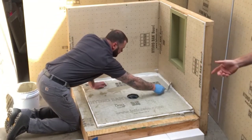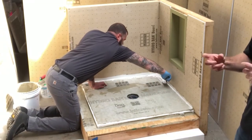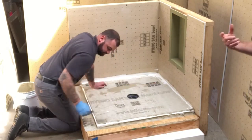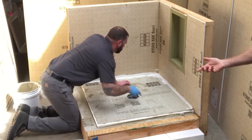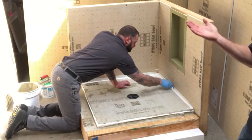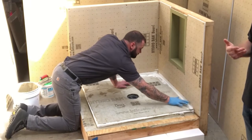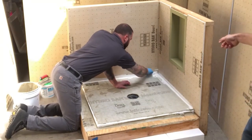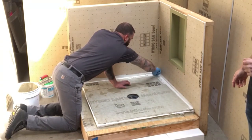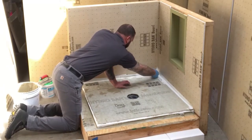All right. Another nice thing here, which to me is a good selling feature over the band in corner, out corner method, is build. We talked about build when you're talking about in corners on top of out corners and then a piece of band on top. A lot of times you'll get a lot of build, which with smaller tiles can really show from an aesthetic standpoint, creating a negative look, where these two ulterior ways of waterproofing minimize that or eliminate it altogether. So very little build with this method as well.